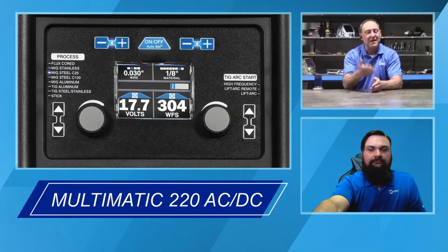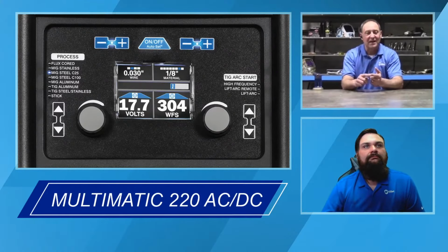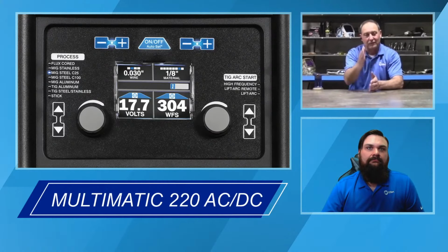All those MIG options you see on this screen are available in our inverter Millermatic MIG machines. The MIG, the stick, and the DC TIG are available in all of our Multimatic multiprocess machines. But the screen we're looking at right here is our Multimatic 220 AC/DC. This is the only machine that has AC TIG in it, which gives you the capability to TIG weld aluminum. If you look on the right-hand side, you can also see a couple of options on how you want to start your TIG arc.